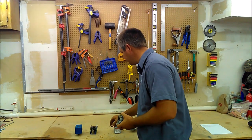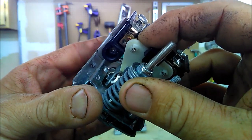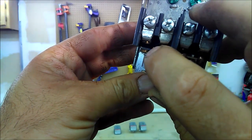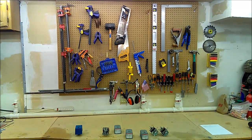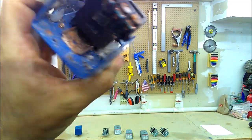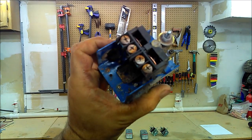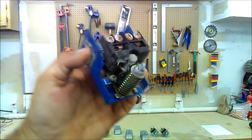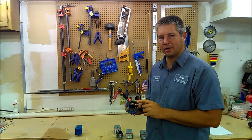Another thing that we see quite often is you get ants or spiders in the pressure switch. You can barely make it out but there's a little black ant up in that corner, and another one on the bottom side — that's just enough to keep that switch from contacting. Along with ants, we also have small spiders around here and they've been known to get in the switch too. You can see the spider web in the bottom. Actually this switch here was still operational until the time the pump was pulled — it had probably been in there for close to 20 years, so not really in that bad of shape. Along with ants and spiders, even just dirt blowing in can put enough dirt into the points to prevent them from working sometimes.